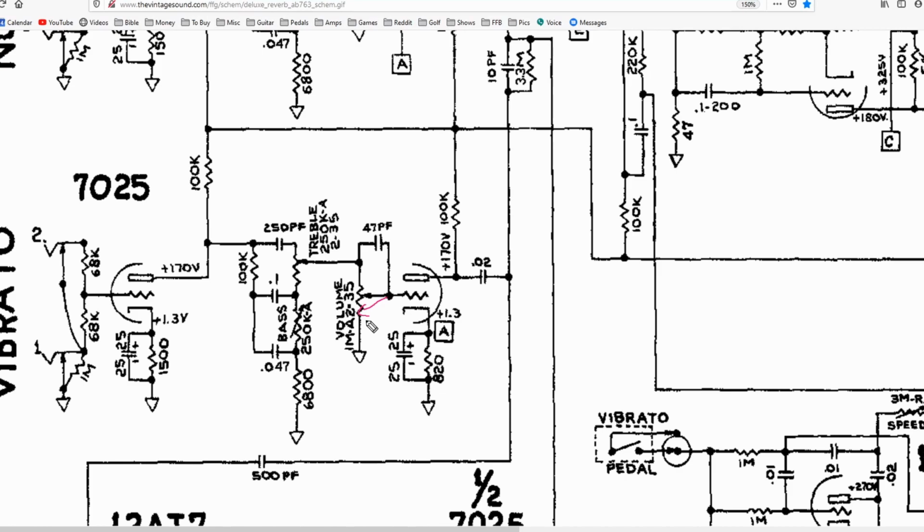So I would say it's most important to be thoughtful not just of how your tone sounds clean with the bright switch, but also how it sounds when you put on an overdrive pedal. It's really just about balancing all of those things together. If you like to use a lot of overdrive pedals, you may find that putting the bright switch on makes those drive pedals sound really, really harsh. Or maybe you've got an amp where all of the drive pedals you put into it sound really, really harsh.